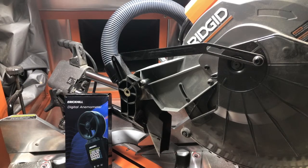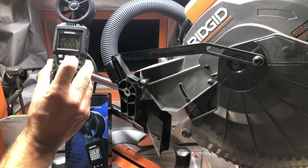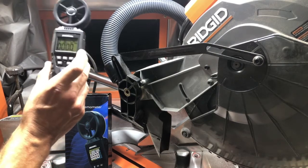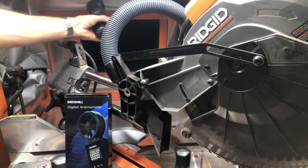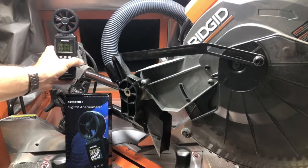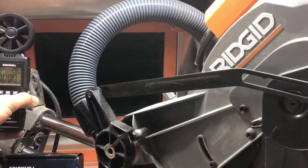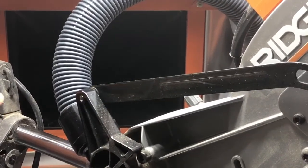I'm going to turn it on quick. We'll take some measurements and I'll turn it off because it's obviously really loud. The other thing I'm going to do is switch it to average — you hit record and it cycles through max, min, and then average. So I'm going to put it on average and then go ahead and put it right up in that left corner.